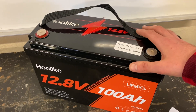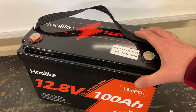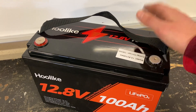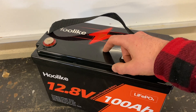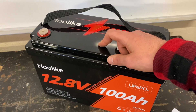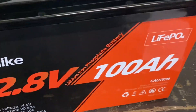That's pretty cool. Usually standard batteries are IP65 — the 5 meaning they can withstand normal splashes and rain and stuff like that. But this one you could actually drop it in the river, pick it back up, and it should work just fine. The labeling is pretty straightforward.